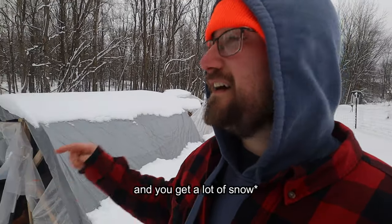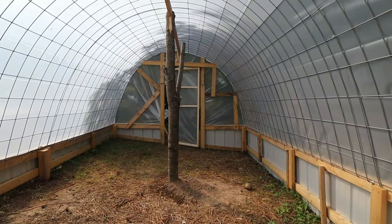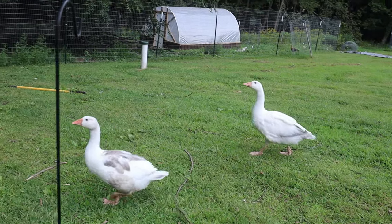Overall this thing has handled snow very well — a lot better than I was even expecting. I would say if you're building one of these in winter conditions, invest in a ridge beam. We used a 2x4 ridge beam and a log to support it, and that's working out really well. These things haven't collapsed and haven't really looked like they've been struggling to hold the snow load after a few storms. I'd give it a thumbs up — just make sure you don't let your geese in here.